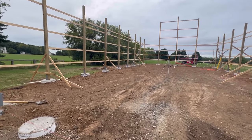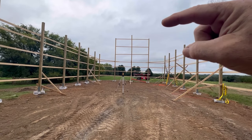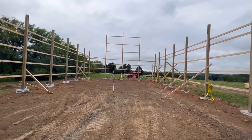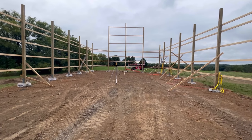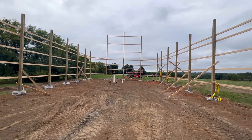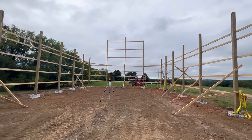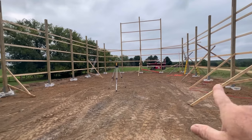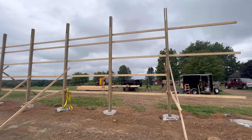We've got three walls up and they are braced off. The top of this end wall — those top three — are just screwed on; our rafter will tie to that. We just wanted some stability when we stood that wall up. It's about a 28-foot pull and we just screwed it together. We'll pop those off when the rafters attach. We've got all our posts in, most of our girts done with a couple on the end still to do, and some temporary bracing in to hold it together until we start getting rafters up.